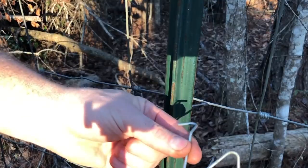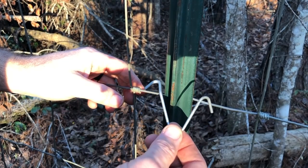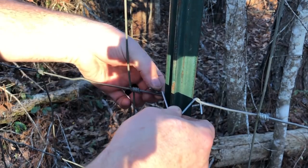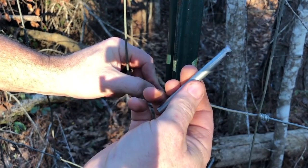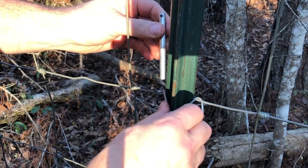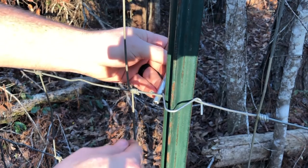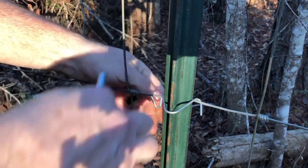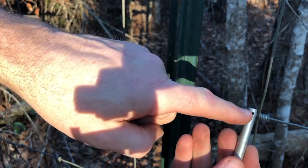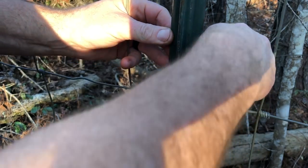So the next time you're having to mount these T-bar wire ties, you just slip it over the wire, bring it back around, take your little handy dandy tool you just made, and you slip this in between that spot there, you just roll it under. Then this end over here that might be sticking up - you take the little hole that you just drilled, put it in there, and just fold it up.